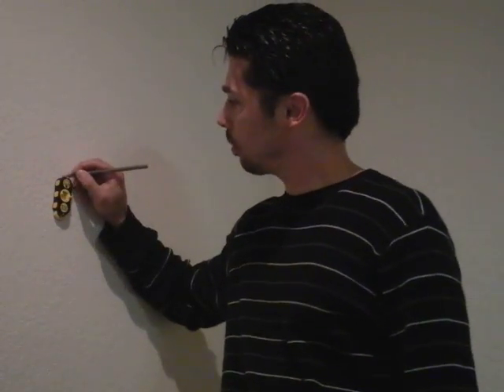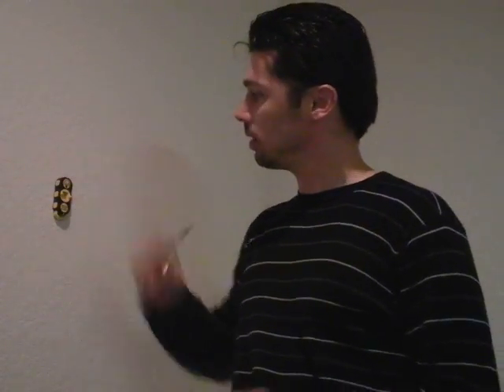So that's actually the center of the stud. This is actually more accurate than most stud finders, and you don't have to replace the batteries, and you can drop it and it won't break. So you mark it right there, put the screw right dead on where the line is, and you'll be pretty much dead on.